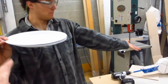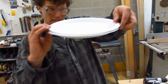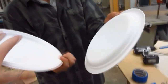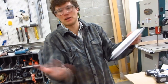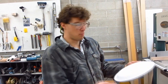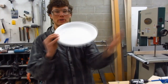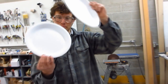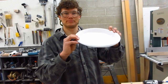Because of the type of mold we're going to be using, we can actually make the top slightly different from the bottom, so that the only places where they actually contact is around the perimeter, around the edges, and there'll actually be a gap — a hollow space in between the top and the bottom — which can be filled with a polyurethane expanding foam, which will make the core of the board. It's a foam core, conjoined around the perimeter, and a lot of the strength and structure is coming from the types of shapes, thicknesses, and material choices of these two halves after they've been conjoined.